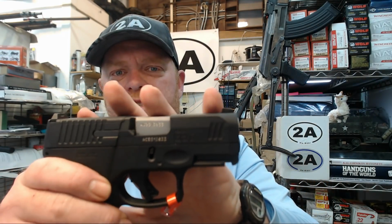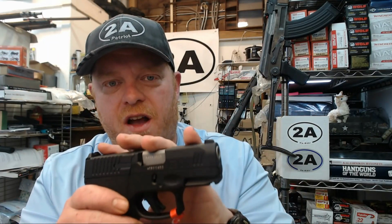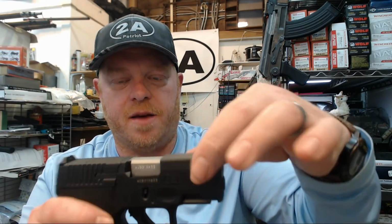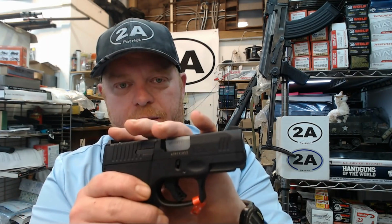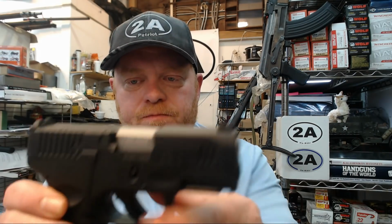It's really a surface treatment and a finish all in one. When you're looking at Tenifer or nitrides, it actually does a surface hardening of the metal, okay? And as part of the process, it ends up giving it the black color. So it isn't really fair to call this a coating. It's actually a surface treatment and also gives it its final finish.